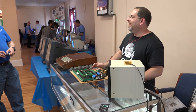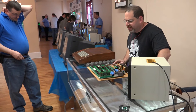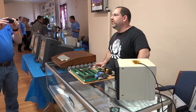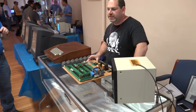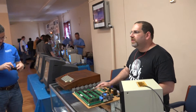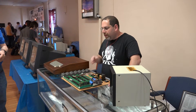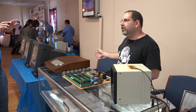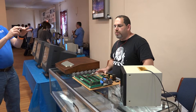It has been fully restored electrically and cosmetically - cleaned and chemically stabilized. The capacitors were brought back to full state through a reforming process. The ceramic capacitors were brought above their Curie point so that they are actually as new. This is one of the only boards that are functional that have all the original RAM on it. It is in near perfect condition.